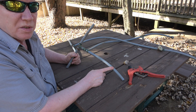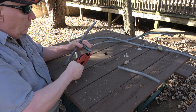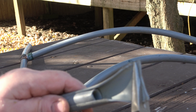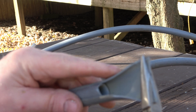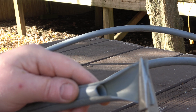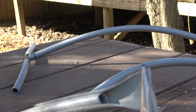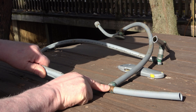Let's slice open a section of this pipe and see what that reveals. Smooth surface, not distorted in any way — this pipe is in great shape. So it must be the chemical makeup of the pipe in conjunction with city chlorinated water that's creating a reaction. When I made the cut, it was as if I was cutting vinyl siding.